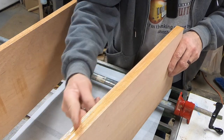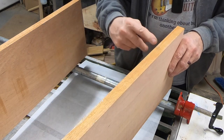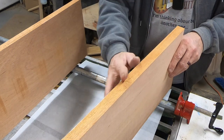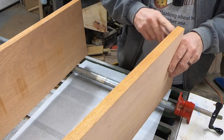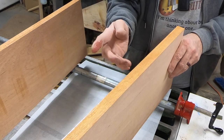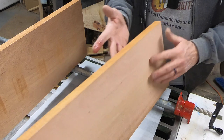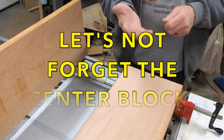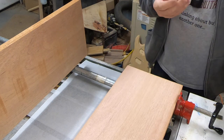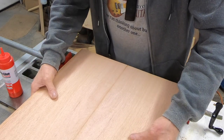I like the fish glue a lot. This is a semi-hollow body, but this particular seam isn't something anybody's going to get too worked up about tonally. The seam stays three-quarters of an inch at this point — it's going to be left two inches wide and then the inside of the top will be carved. So basically, you're not going to have a lot of wood movement right there. Tonal properties of fish glue versus, say, Titebond Original — not really much we could worry about. We'll be right back.